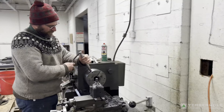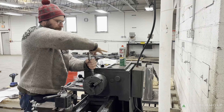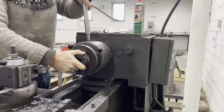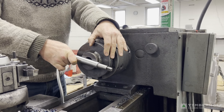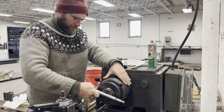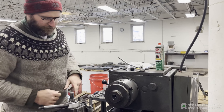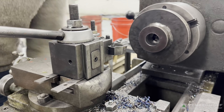First thing, we're going to get this set up — holding from the inside, so I have to shrink these down. Put it on here, get it slightly tight, and make sure it's pushed all the way home. Make sure she's seated carefully, then tighten up the rest of the way. Now we'll check the bit — it's not brand new, but it'll work. That's a carbide insert, Sandvik makes that.